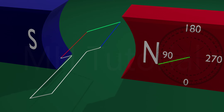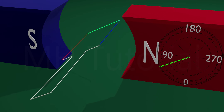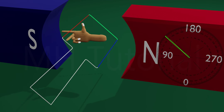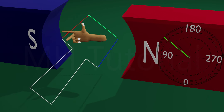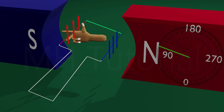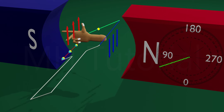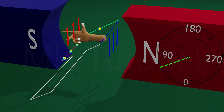the red arm appears to move upward and the blue arm looks like it is going downward. Hold a right hand at the red arm of the armature: the index finger is pointing in the direction of the magnetic field, the thumb is showing the upward movement of the red arm at this moment. Therefore a current will be induced in this arm, and its direction is toward the middle finger — that is, outward.